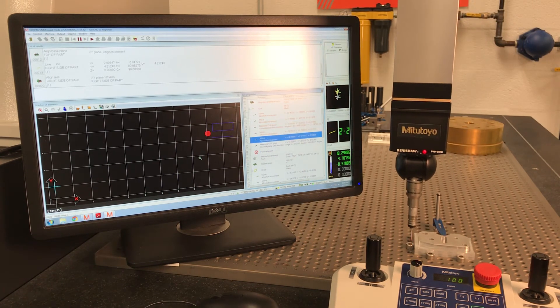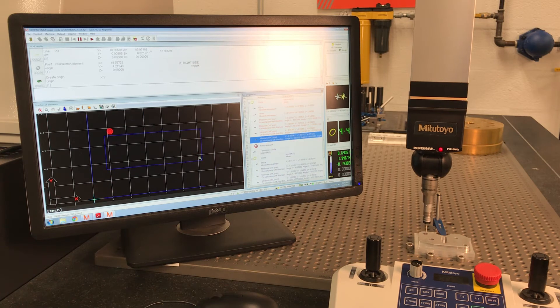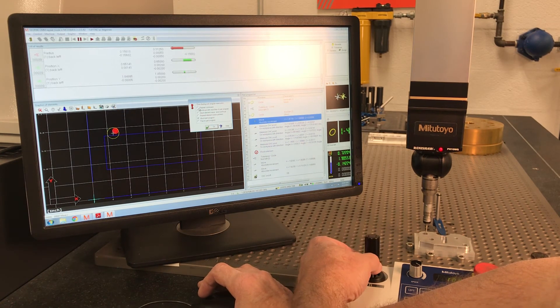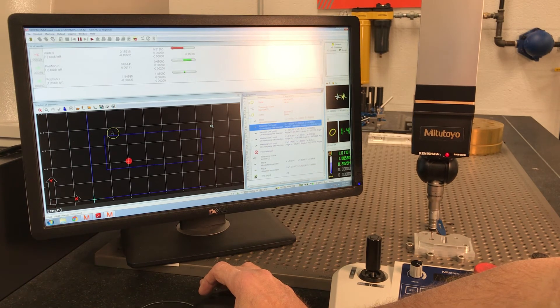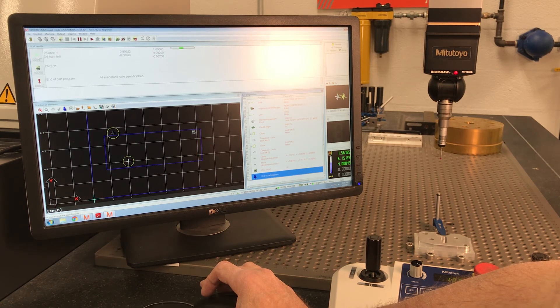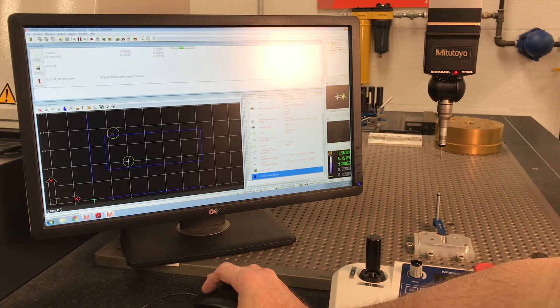It's doing the alignment. Now it's going to come up and measure this hole. It crashed. That's actually a good time to show you — you can hit Repeat Command and pull it up and it should continue. Of course I've got a bad program. Let's go back and fix it. You can click the results window to quickly scan your results, but let's go back and fix this.